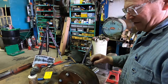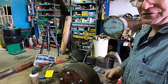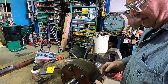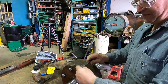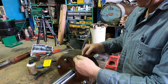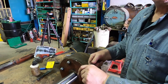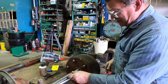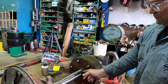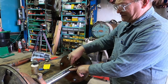I just know I have more depth, so it won't go in all the way, it won't bind other than holding this tight. If it doesn't go in all the way it will still hold it good enough — it doesn't have to. If it goes loose they just come over and tap it again. They had this down to where there was basically no head left; someone had ground it away and was trying to pry against it. So I welded it up so they had some more head to work with.